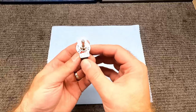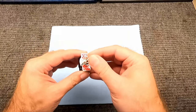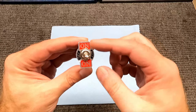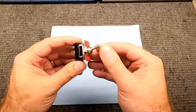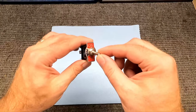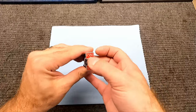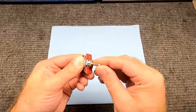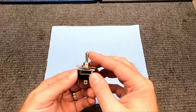To make this work, I'm using a switch — I believe it's a double-throw triple-pole type, though I don't recall the exact name. What I want is a switch that has three positions: on at the top, off in the middle, and on at the bottom. The up position will be auto — where the fan depends on the thermostat switch — and the down position will be the override where the fan is on when I want it.